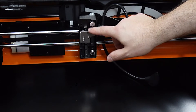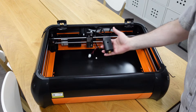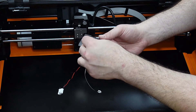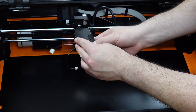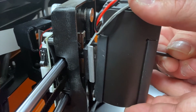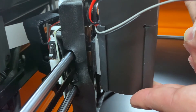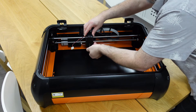We have now modified the laser housing to accept the new 10 watt laser upgrade. Now is the fun part — we get to place the new 10 watt laser upgrade onto the mounting plate. To do so, grab that large screw and place it right in the middle. You can see it slides straight in. I'll take my 2.5 hex tool, move the cables to the side, and align it with the top hole on the plate. The laser unit will actually slide and lock in to the plate. Unlike all the other screws, this one you do want to tighten up — you don't want any wiggle room on the laser since it's going to be moving around the work area. Make sure it's nice and tight with no give.